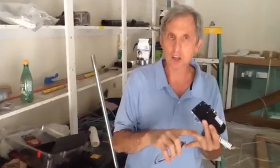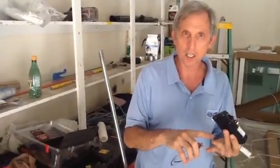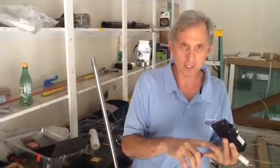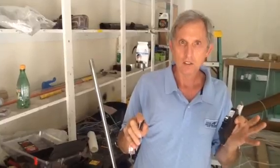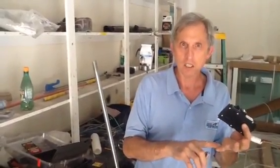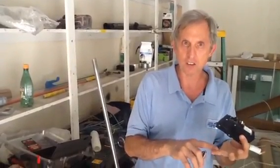Let me tell you where they go. They go into your bedrooms, they go into your dining rooms, they go on your lighting circuits, they go in your libraries, they go in your parlors, they go in your lanai areas. They pretty much go all over the house. The other circuits that it doesn't really pertain to would be dedicated circuits, such as kitchen GFIs and bathroom GFIs and outside GFIs.